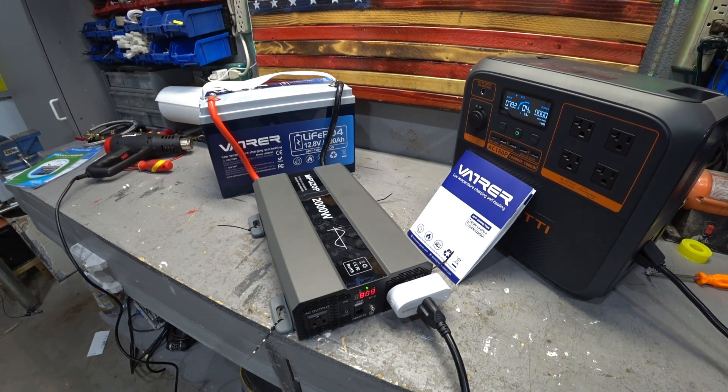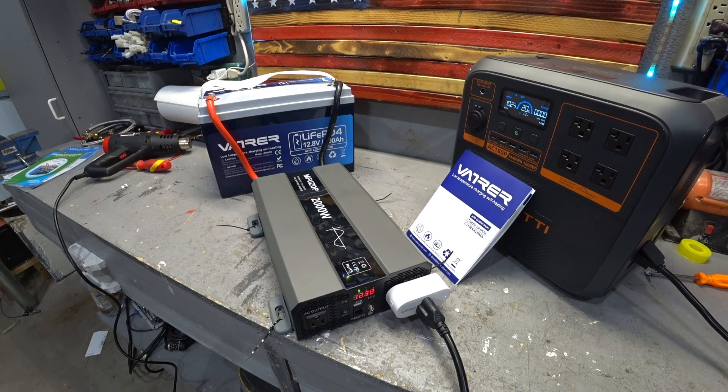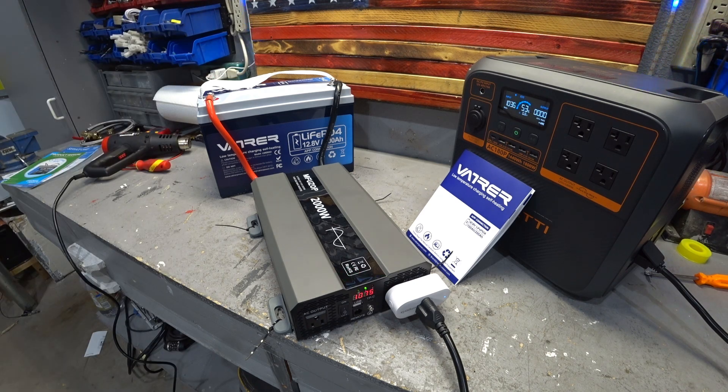Power on — it's charging and we're good to go. The test bench is set up, the camera is recording. It's already pushing 976 watts. I've sped up the video to over a hundred times so one hour basically happens in 30 seconds. This is how far the battery was able to be charged. The sensor shows it pushed 1.2 kilowatts — 1200 watts worth of power through the Emporia sensor. With about five percent losses in the system, it has at least 1280 watt-hours in it, and it's not hot at all.